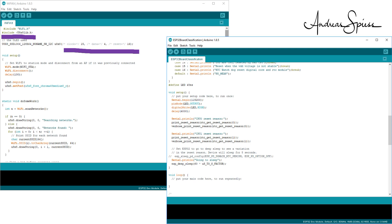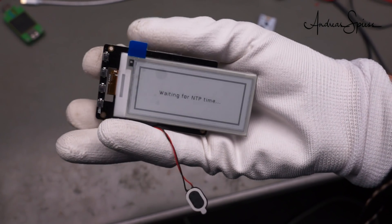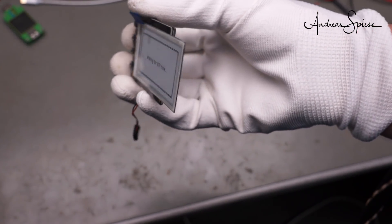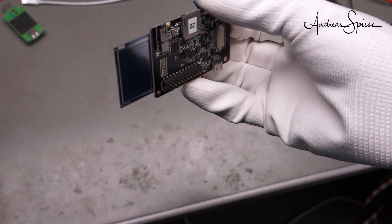The second sketch is simple. Based on the deep sleep example, I added a delay in the beginning to measure the idle current, then the board goes into deep sleep and I took my measurement. It does not make a lot of sense to deep sleep boards with OLED displays, because during deep sleep the display has to be switched off or the current consumption would be high. This is why I did not measure this value. The board with the ePaper display, however, is made for deep sleep — you change the screen and go into deep sleep, and the display keeps its content.